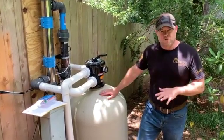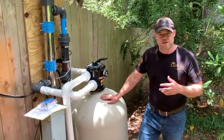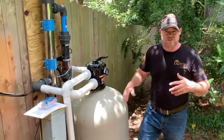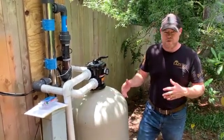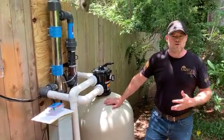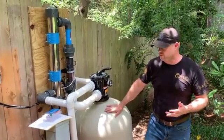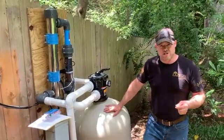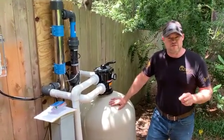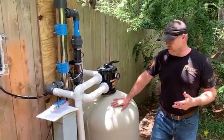With a glass filter you probably will not need to backwash weekly — it's going to be more like every three to four weeks. That may vary if storms move through the area and fill the filter up earlier, but under normal usage it's about every three to four weeks. Also, when you backwash the glass filter you won't need to backwash as long as you normally would with a sand filter, because the glass media tends to clean much more easily than sand.